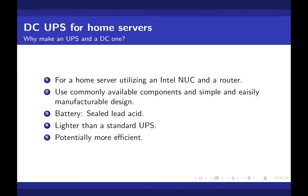The standard UPS converts AC power, stores it in a battery as DC, then converts it back into AC at 230 volts. Our idea was: how do we make it simpler without undergoing all of those conversion steps? That's where we thought we should try to make a DC UPS.